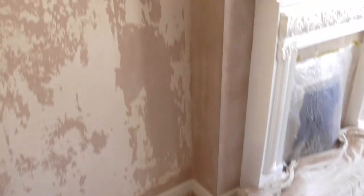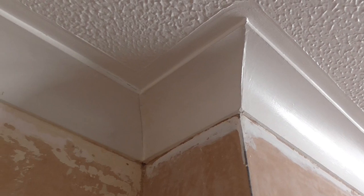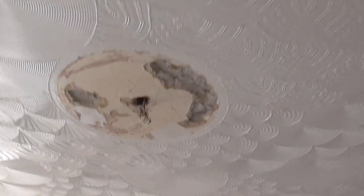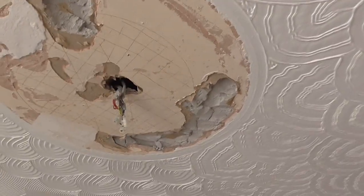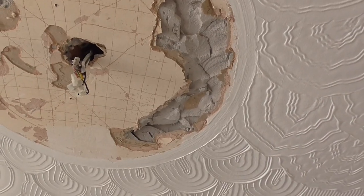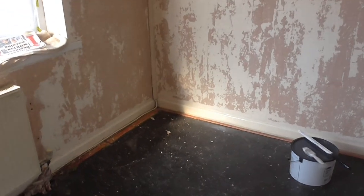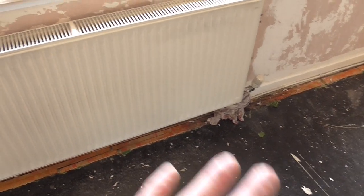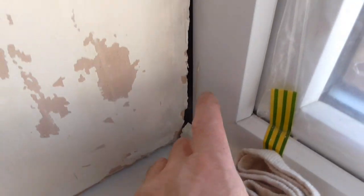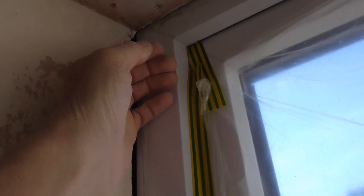Coming back into this room, any cracks in the coving are going to get fixed. A little bit of a hole - bit of foam, sorted, won't come back. That ceiling rose was a bit more difficult to come off, so it needs a bit more filler in there. I'm going to use some undercoat plaster, then a bit of polyfiller to smooth it off, and then Artex inside that. Now radiators are going to come off, so that will make the job a lot easier. Round the window - that all needs doing. I'm going to put some foam in there first and a bit of filler, make sure it's draught proof.